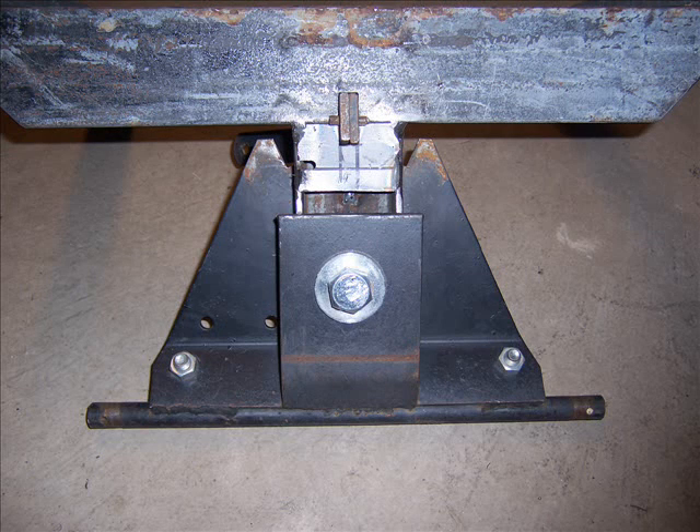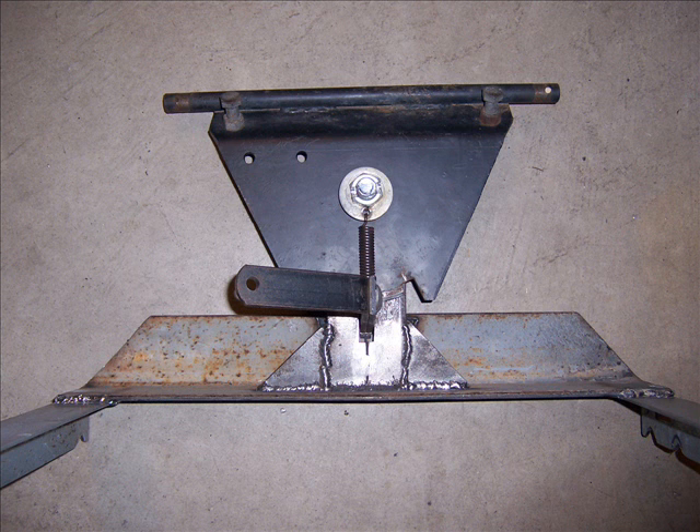Here's the spring that holds the latch controlling the pivot in place. There's a bottom view of that same thing with a roll pin that goes through the latch so that it pivots on the roll pin. I cut all these grooves before I did any welding, cutting them with a four-inch angle grinder. There's the whole thing put together — you grab that latch, pull it back, and you can rotate the front piece 45 degrees either direction or put it vertical.